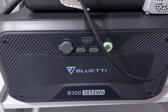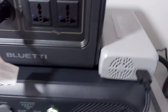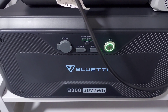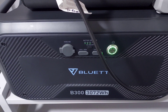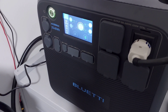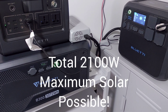Now we've got this big boy — the B300 battery with 3072 watt-hours. To keep it charged up, it can already take 200 watts of solar coming in, but now we've got two D050S units, so we can use the second one to charge the B300 at 500 watts. That gives us 700 watts into the B300, plus 900 watts possible through the PV on the AC200 Max — we've actually seen 930 watts — plus 500 more. This means the whole system could be inputting 2 kilowatts of energy from solar.